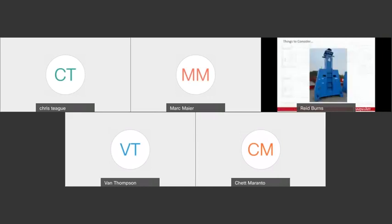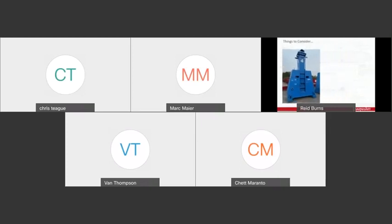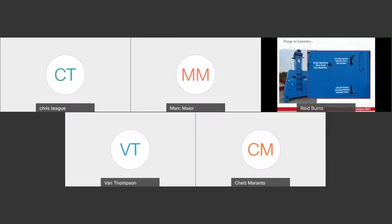So another thing to consider, and here we have a standard J&R lift and lock style 500-ton gantry leg. And when this gantry leg's in operation, one of the most important things to watch out for is the mode that this leg is in. And so let me explain. The hydraulics of a gantry leg are plumbed such that you have selector valves that divert that hydraulic fluid either into the main lift cylinders for when you're actually lifting the load, or into the hydraulic drive motors when you're trying to travel the load. And there's also a freewheel setting that allows the fluid to bypass the hydraulic motor. And this is what you use when you're lifting the load, but you want to allow the legs to move slightly just to find center.